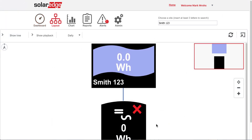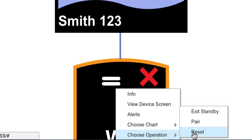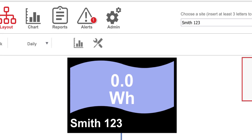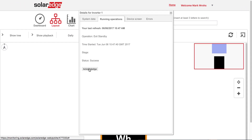In the layout view, go to the inverter, right-click with the mouse, your menu options show up, choose Operation. We're going to select Exit Standby, and it gives you a little alert notice. Effectively what we're doing is sending a remote command to enable the inverter. Exit Standby — success. We've been successful.